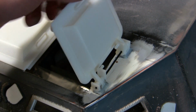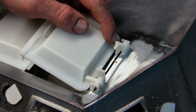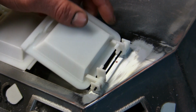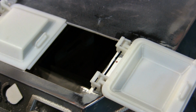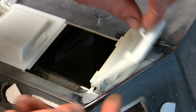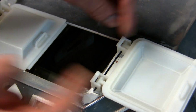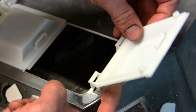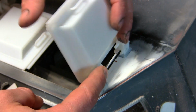So it's going to open up. The hatch here is going to impinge onto this flat area found on the counterbalance, and when it does, then the entire unit will pivot in unison just like that. Then to close the hatch, you'd simply grab the handle, and right now there's no spring here putting constant pressure up, but when there is, these two sections are going to be pushing up on the bottom portion of the hatch and assisting it with the closure.